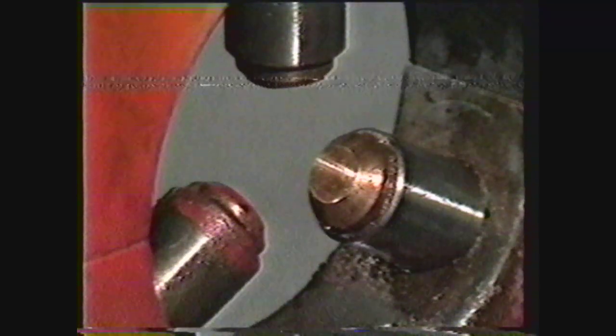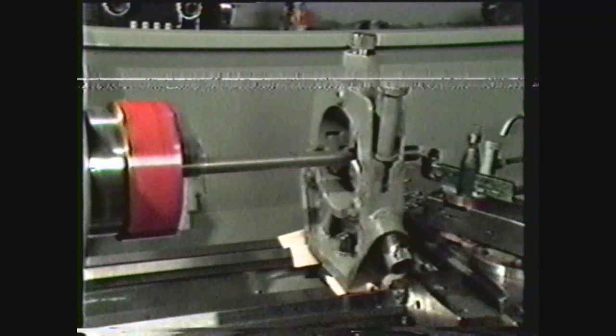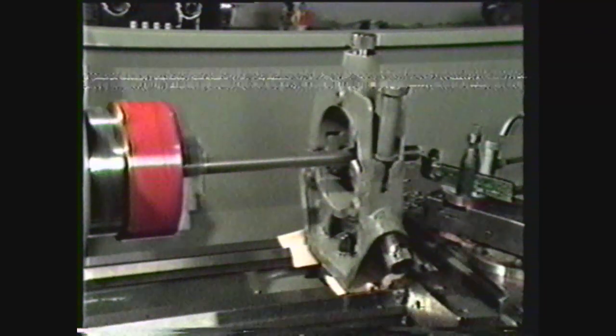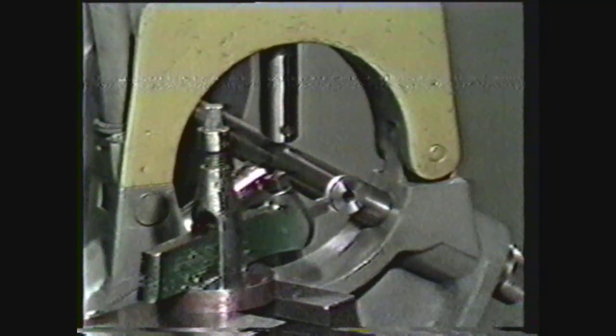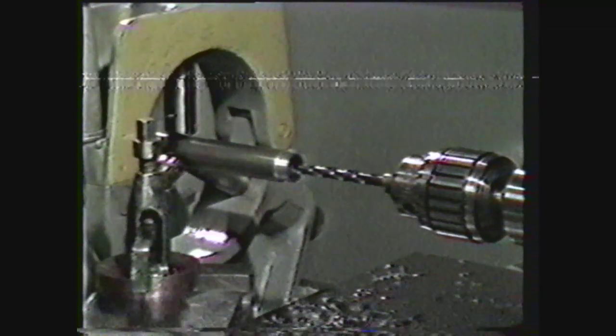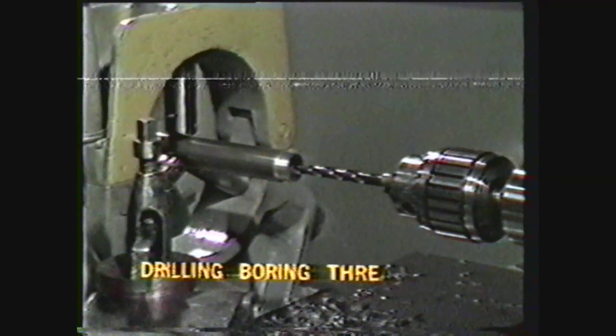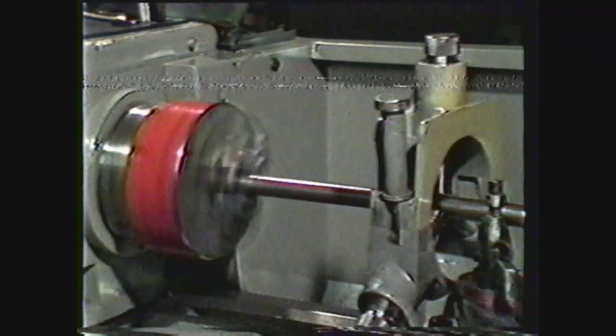The jaws are tipped with bronze, plastic, or ball-bearing rollers. The steady rest can be used to prevent springing or deflection of slender work, to furnish auxiliary support to permit taking a heavier cut, or to support the work for drilling, boring, or threading operations. It can be used on work held in a chuck, or work held between centers.